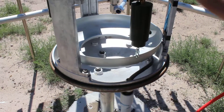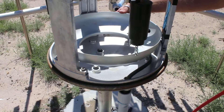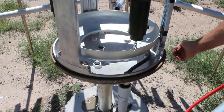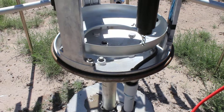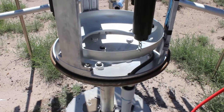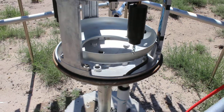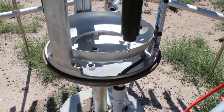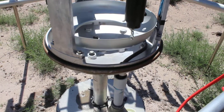You can kind of hear the high-pitch sound. That's a frequency we're reading. We do a field calibration based on the frequencies — as we add weight the reading goes up, and we just do a curve to that. That's where we get the calibrations for these.